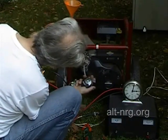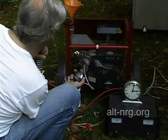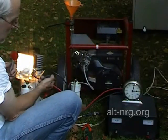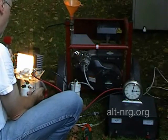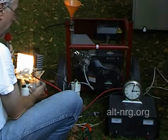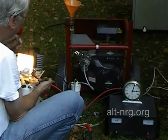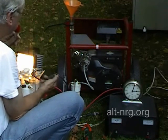According to the AC ammeter we're drawing 5.93 amps from 120 volts AC — this is AC coming in from the house right now. In a moment I'm going to transfer it over to the outlet from the generator and rerun this same test with the additional load now placed on the generator.